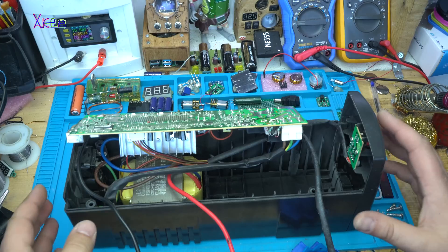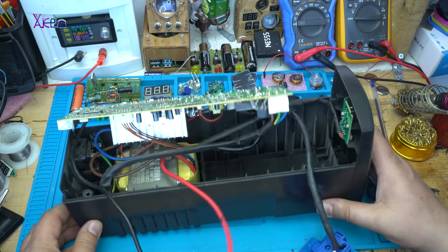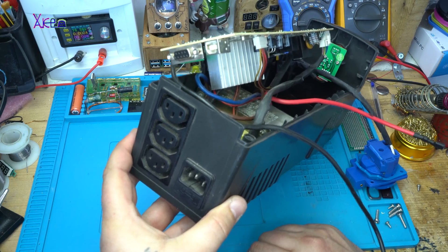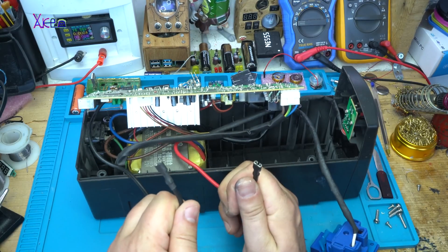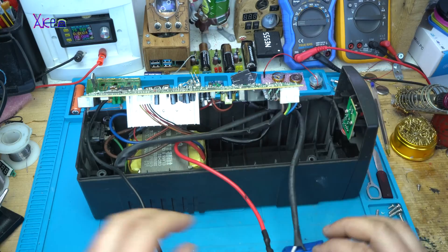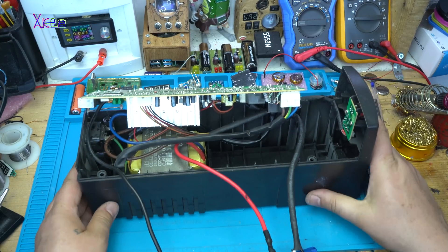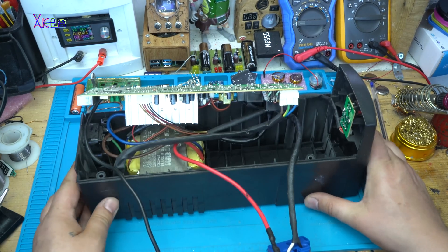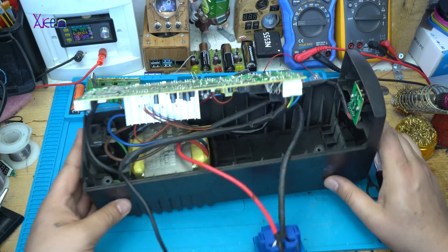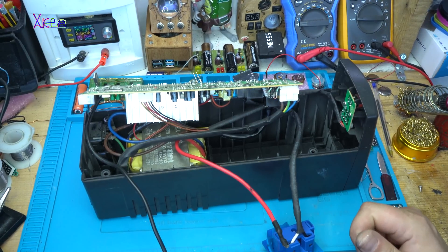This is great — so here's how to use the UPS if you have one laying around, maybe in your garage. You don't need to plug it into the grid. Just attach a bigger battery with more capacity, no more than 12 volts, and make your own power outlet like mine — and you can have a free power inverter box. This will be a great project. By the way, I found this thing in the garbage — it needs new life. Thanks for watching. Please share, subscribe, and like my video.